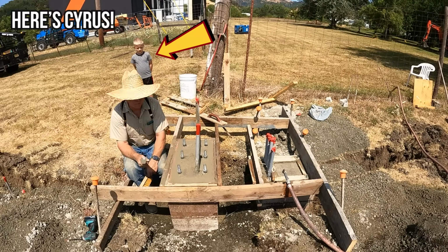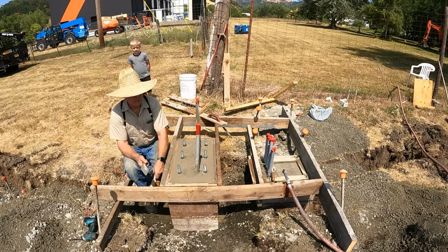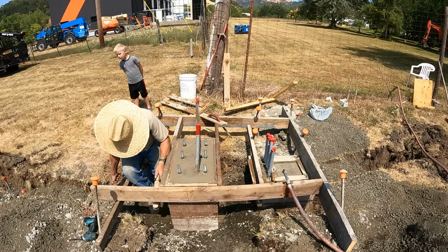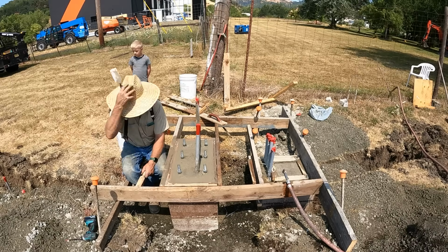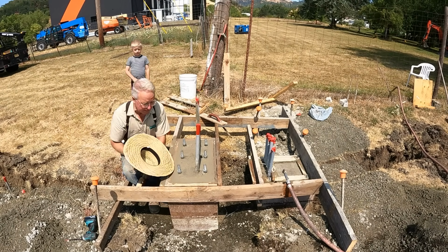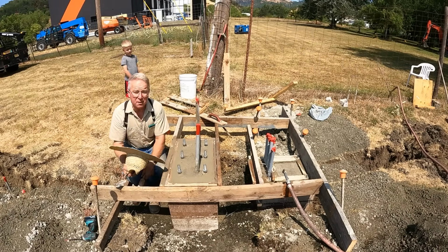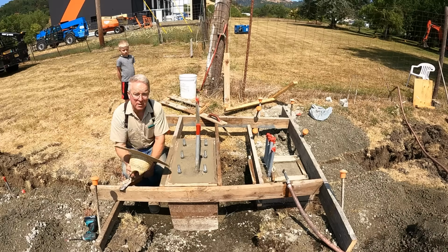This concrete dropped into this form about 3.5 hours ago. And it is hard. I mean, it is hard. You know, ordinarily you don't want to strip templates off of anchor bolts because you don't want to disrupt the anchor bolts, but I didn't hurt these a bit. And I'm just trying to get a little nicer finish around the edges that are going to be exposed. I think I'm worrying about nothing, but it's a nice day and all I've got to do is clean this up. So I'm just going to let this dry out a little bit from the surface water I just put on, broom it, and call her a day.